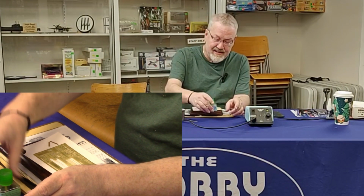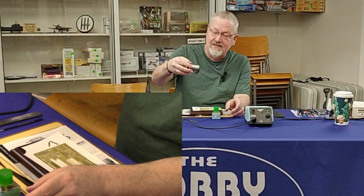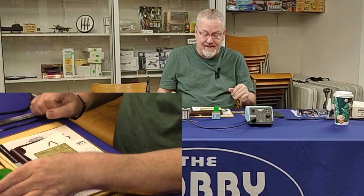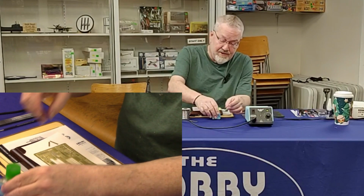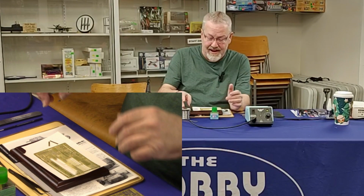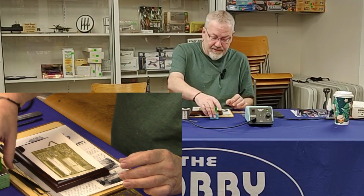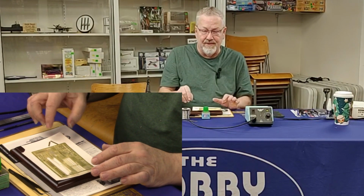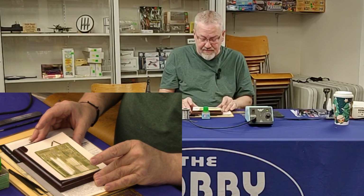What I'm going to do now is show a few of the basics of soldering. The tools for soldering: I've obviously got my Kester solder, and it's a rosin core solder, so it is basically a tube that has some flux in the center. Generally, there's not enough, so I also have resin flux. Depending on where you live or what's available to you, as long as you have a solder and a flux that is compatible, you're going to be fine. The purpose of the flux is to break up the surface tension and allow the solder to flow incredibly smoothly. It literally flows like water.